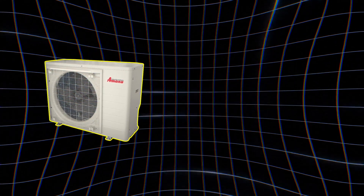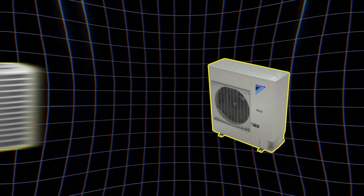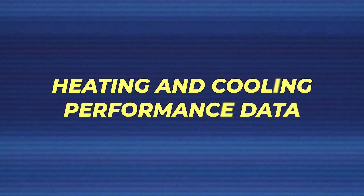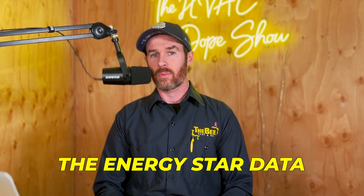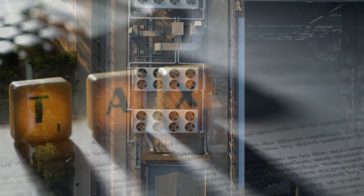In this video we're going to be doing a head-to-head matchup between the Amana S Series, a side discharge heat pump classified as a cold climate heat pump, and the Daikin Fit Enhanced, also a cold climate heat pump. We're going to go over efficiency ratings, COP data, and do a deep dive into the actual manuals showing heating and cooling performance data. We'll also cover Energy Star data on which systems qualify for the heat pump tax credits — both these systems qualify — and we'll show which tonnages qualify.